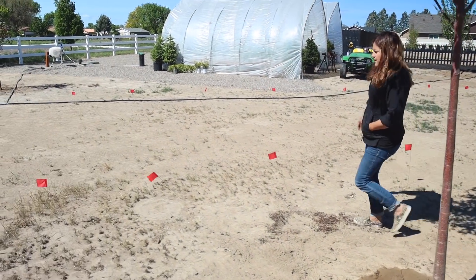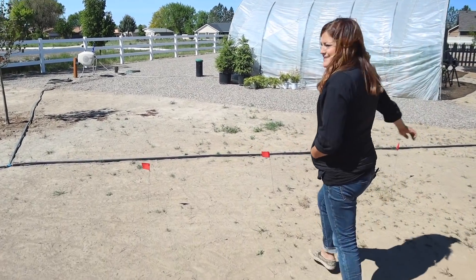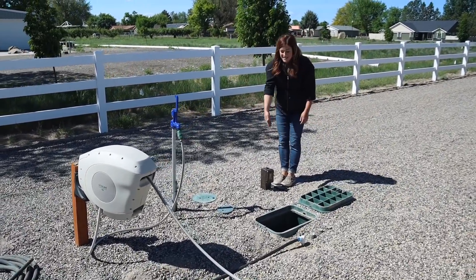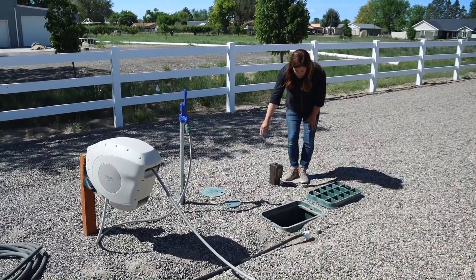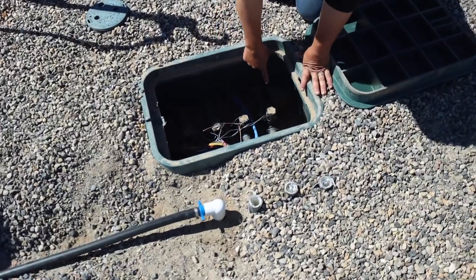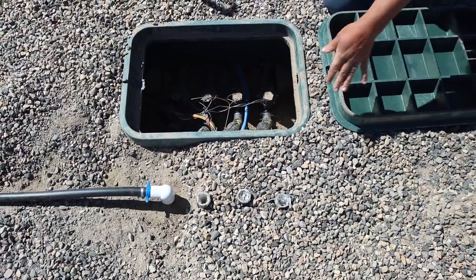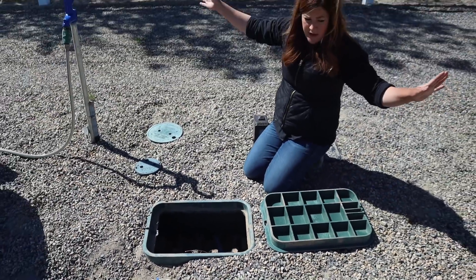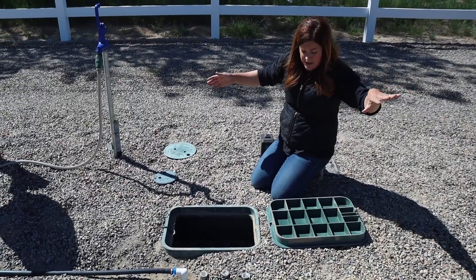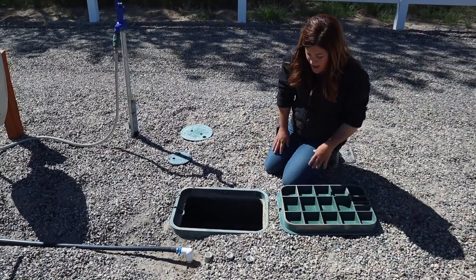So the water originates over here. Our main water line actually runs right about here — they tapped into the main water line and brought up a supply right here. It goes into four separate zones. We have three open zones that we can tap into for whatever we need — like the high tunnels right in front of me, which are full of plants we're using for projects. If we want to set all of those up on drip, we can tap into one of these zones and run drip off of that.